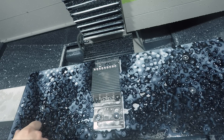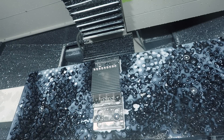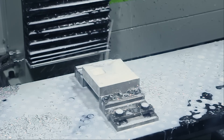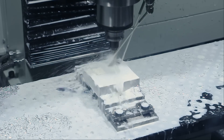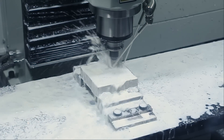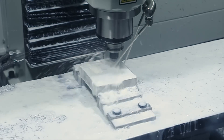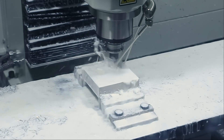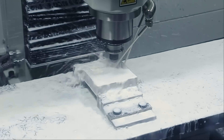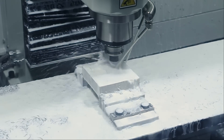Expect to see a lot more of that in future videos. Now back to that quarter-inch tool to see what this thing can do on adaptive pocketing. Power in the 8k range is excellent. It could use a bit more coolant pressure, but it keeps the chips out of the immediate path of the cutter. It'd be nice if there was enough force to blow them completely away, but that's just sort of a nitpicky thing.